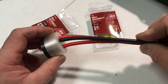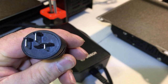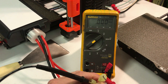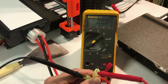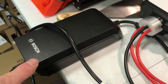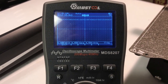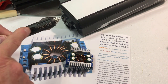Now we've got the Bosch plug, and we have to figure out how to connect to the battery and determine what it needs to be charged. The Bosch charger plug clearly labels the plus and minus pins, but it doesn't say what the third pin is for. The first thing I learned when you hook up the battery to a voltmeter is that you get nothing between the plus and minus, so I thought that third wire must be doing some kind of enabling. I carefully set up a man-in-the-middle hack where I'm testing my new plug with the Bosch charger — and it is charging. I hooked up my scope to that third pin and it turns out it's only 5 volts; there's no data signal on that line.